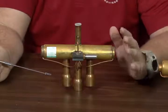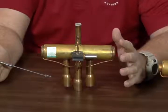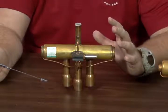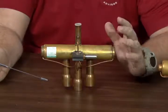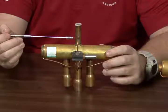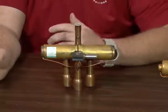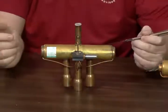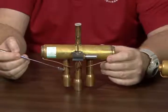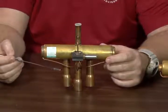That number is always the source of controversy, because lots of guys have been taught 7 degrees, and then over time it became 5 degrees. Now most of the manufacturers and most of the service techs that do a lot of heat pump work agree that 3 degrees is the standard for the acceptable maximum differential from discharge to what becomes discharge. Guys will also use that for the temperature of what should be their cool suction. So again, in cooling mode, testing the top side against what becomes discharge going to the outdoor coil as the condenser, not separated by anything greater than 3 degrees.